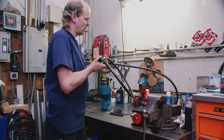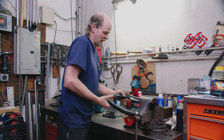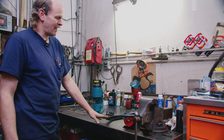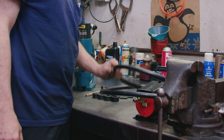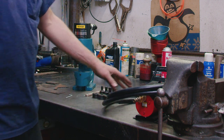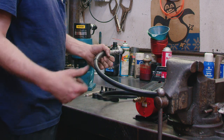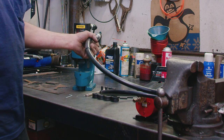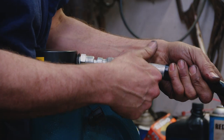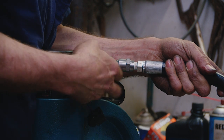Quick safety note: this hydraulic hose was made by a specialty hose shop. You cannot go over 8 feet with a 10,000 PSI hose. The reason is if the hose were to rupture or snap and separate, it would whip around and potentially hurt you. So they don't make hoses over 8 feet long in 10,000 PSI.